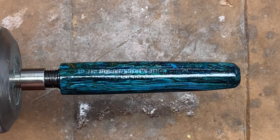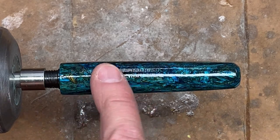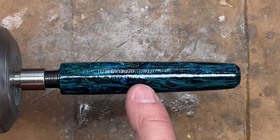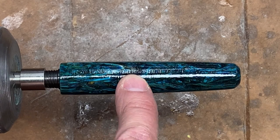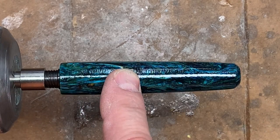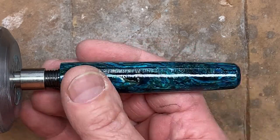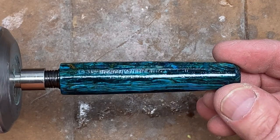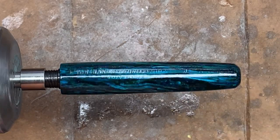My CA application is complete, and if you look at the blank right there, you'll kind of see a little rough area — but it feels level. I think once we sand it down and put a couple more coats of CA, it will disappear. And then the really rough spot we had in the middle — it's bubbled up just a tiny bit. I think the reason why is that stalk was kind of frayed, and as those frayed ends took the CA glue, they curled up a little bit. We'll just sand right through that, micro-mesh, and that should get rid of it. A couple more coats of CA and those will disappear — this pen is going to look amazing. I love the blues and the greens in that.